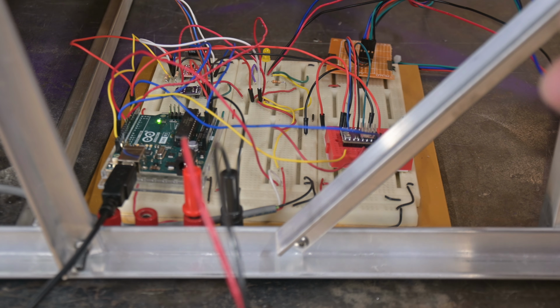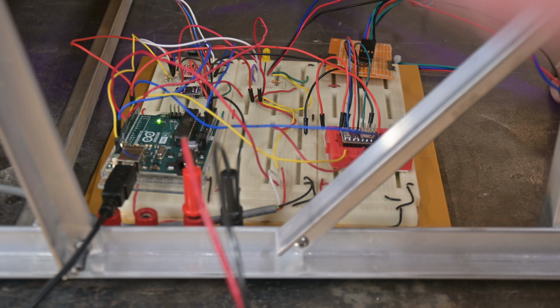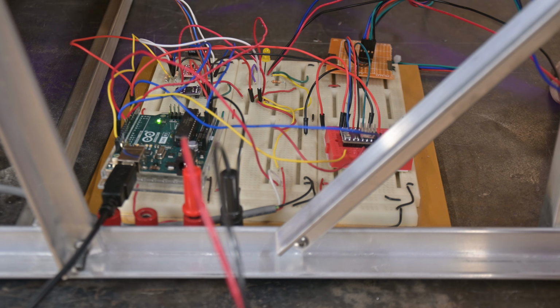So it allows me to basically activate the driver when I'm going to move it, and then immediately shut it off. The idle current on there is only maybe 20 milliamps with the whole thing sitting there. Once you jump up to run the stepper, it's running about 1.5 amps, I believe, but it's only on for a couple seconds, and then it's back down. So you should get a really good runtime out of a 4S LiPo on this thing.